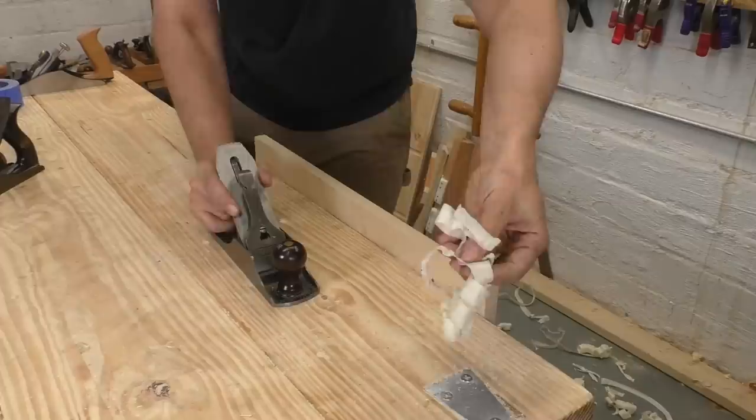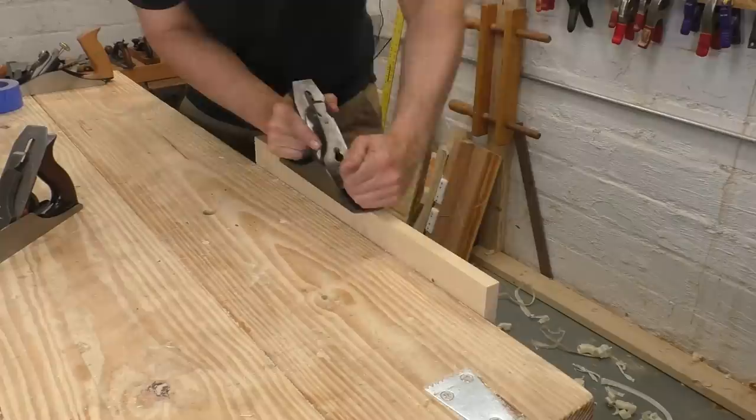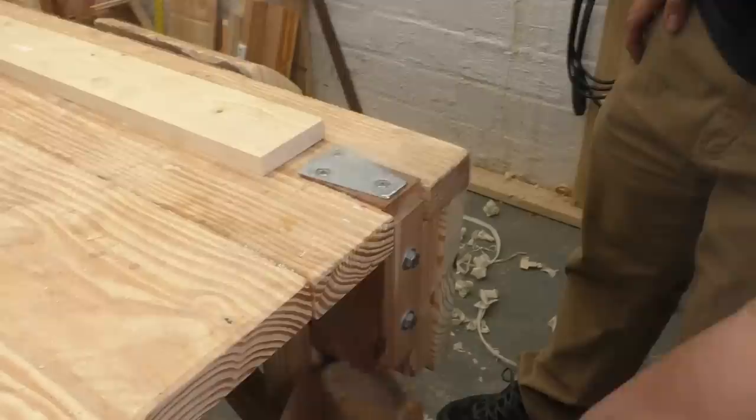The bedrock plane is solid on the wood. It glides into the cut smoothly, and the shaving is feathery — you really can't ask for more. So let's switch to the Bailey with its sloppier construction and inferior frog design. And it's honestly kind of exactly the same. Same shaving, same surface, same effort. I can switch back and forth between the two planes all day and I hardly notice the difference. But edge planing white pine? Come on, that's kid stuff. Let's get serious.